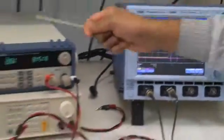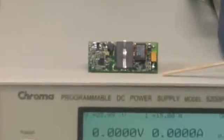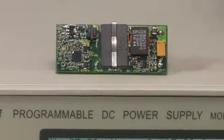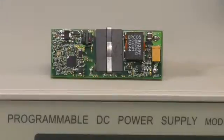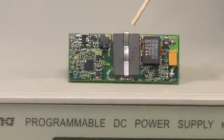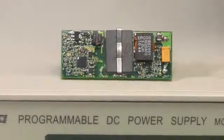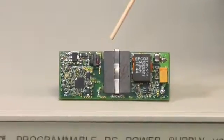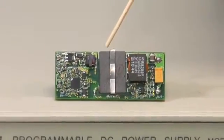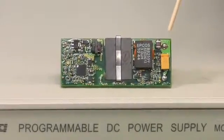Let's take a look at a 16th brick which demonstrates LM5046. In the past it has been extremely hard to achieve a phase-shifted full bridge in a 16th brick size. This is due to the complexity of the topology, lack of availability of controllers, and lack of design practices where an external commutating inductor was used to achieve zero-volt switching. But in this design, in this integrated transformer, the leakage inductance has been deliberately increased so that zero-volt switching can be achieved without using an extra part. Using these techniques, a small form factor design can be achieved.